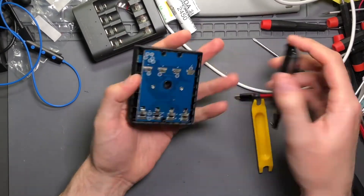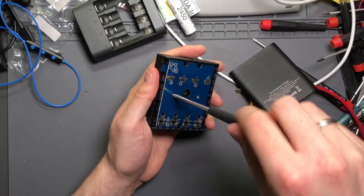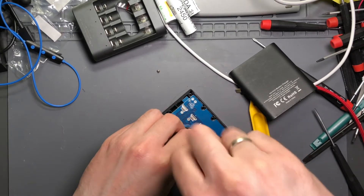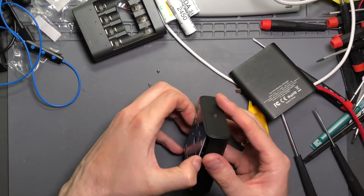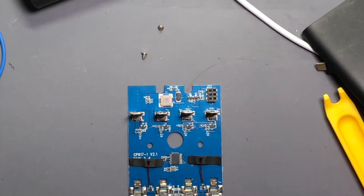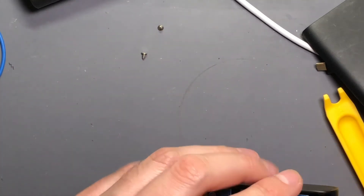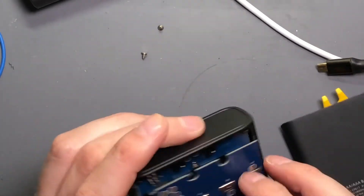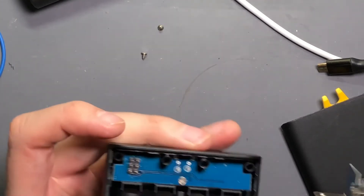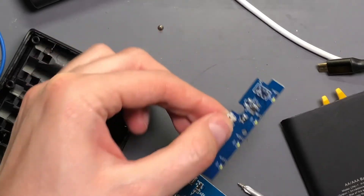I'm comfortable with that because what's likely causing it is that this is a two-piece assembly. It has two short little screws in the back. There's a two-circuit-board assembly inside — a bottom one and a top one — and they're connected to each other via a six-pin header. I'm pretty sure that when they assembled it, this back panel is pressed in and holding that connector together. Also, the pins are a little bit short — I noticed that. Maybe they just aren't long enough.